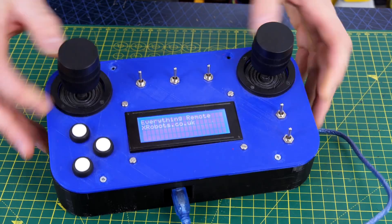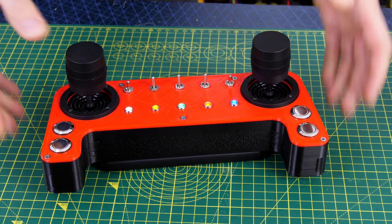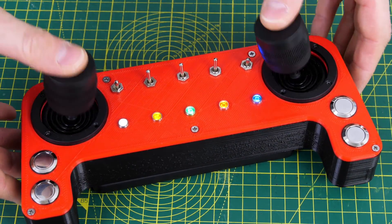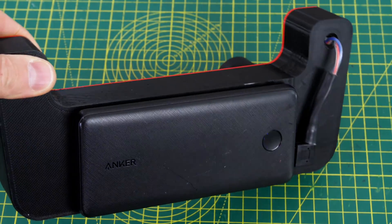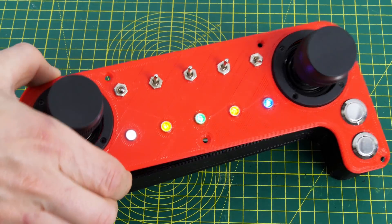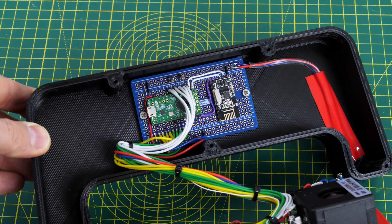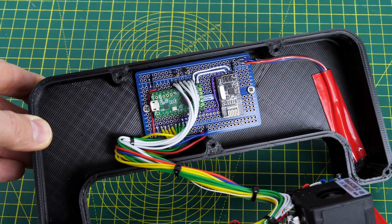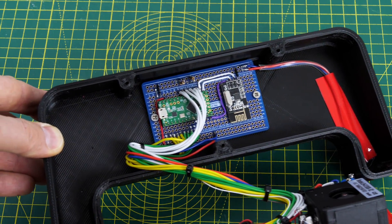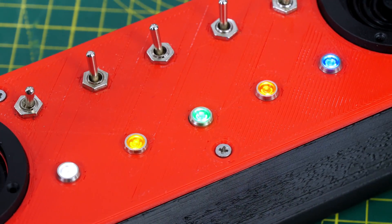I normally use the Open Dog one and two remotes for everything — I've now called it the everything remote — but it's looking a bit worn out and chunky so I've made a nice new version for Open Dog 3. This one's got one extra additional button in addition to the menu buttons, some switches as the last one had, and two three-axis joysticks. It's all powered with a USB boost bank on the back which is 10 amp-hour and can apparently power it for four days straight. Inside is a Teensy LC and an NRF24L01 radio chip, just sending the data set over the radio to the dog. There are two resistors across the power line which help load up the USB boost bank so it doesn't turn off thinking the phone is charged — LEDs were fitted for this purpose but they drew too little power.